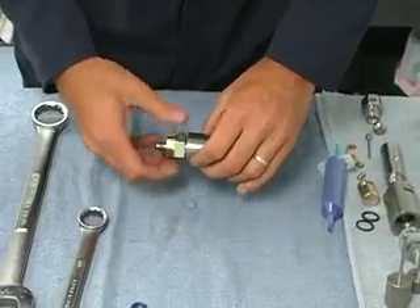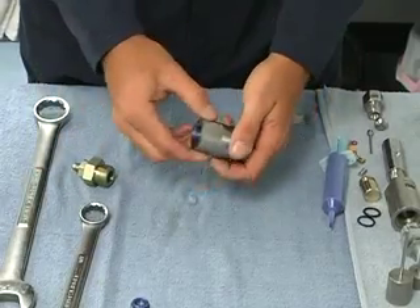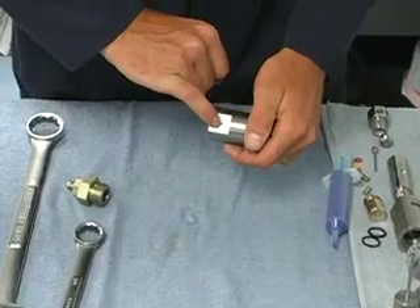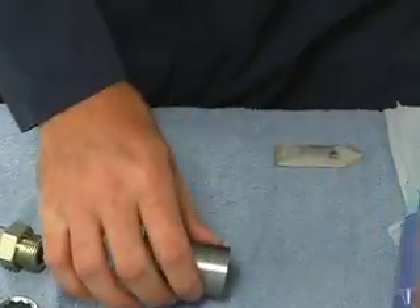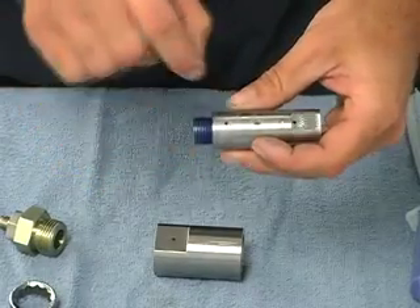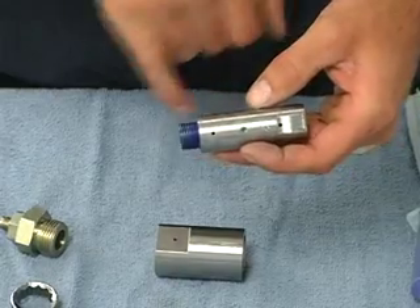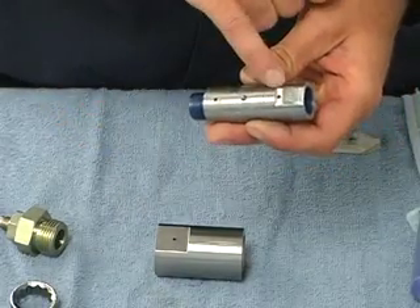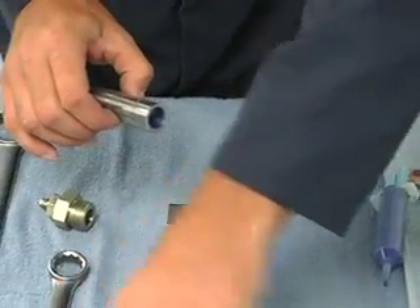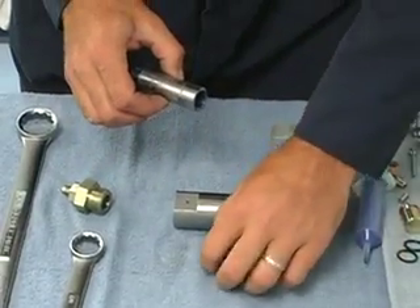This is our hydraulic portion of the valve. The way we know these seals need to be replaced is we'll get some oil coming out of this weep hole. On the high pressure side it also has a weep hole — if we get water coming out the hole closest to the threads, that means our seal is leaking. If we get water coming out the other end, that means this poppet landing seat has a bad seating surface or it's not tight enough.